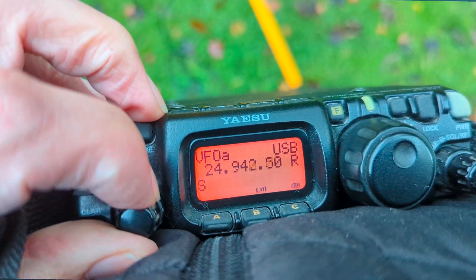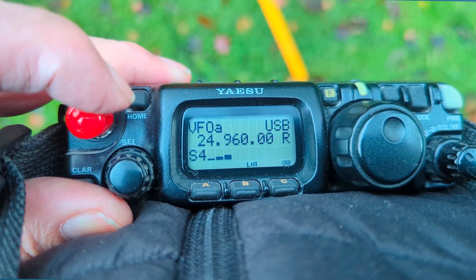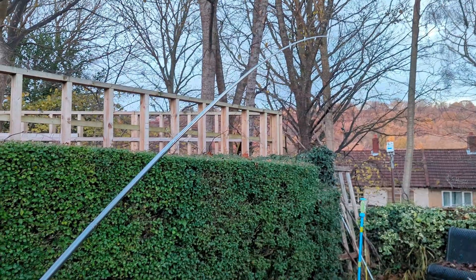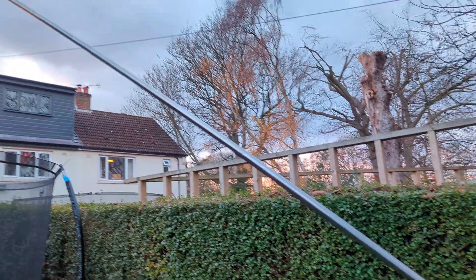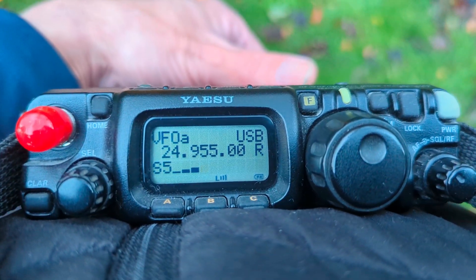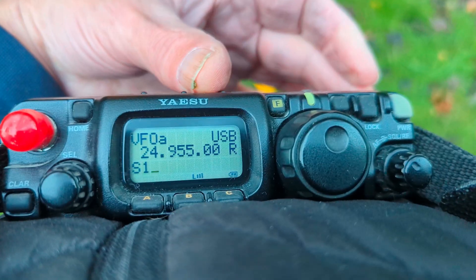So the 12 meter band. I'm hearing a station — DX 5000 MPL — running a seven-element six-band Yagi, a Mosley PRO-67, pushing about 1 kW. He's getting a 59 plus report in Kentucky, so the band must be in very good shape this morning. Great on 12 meters — let's go down the band a bit further.